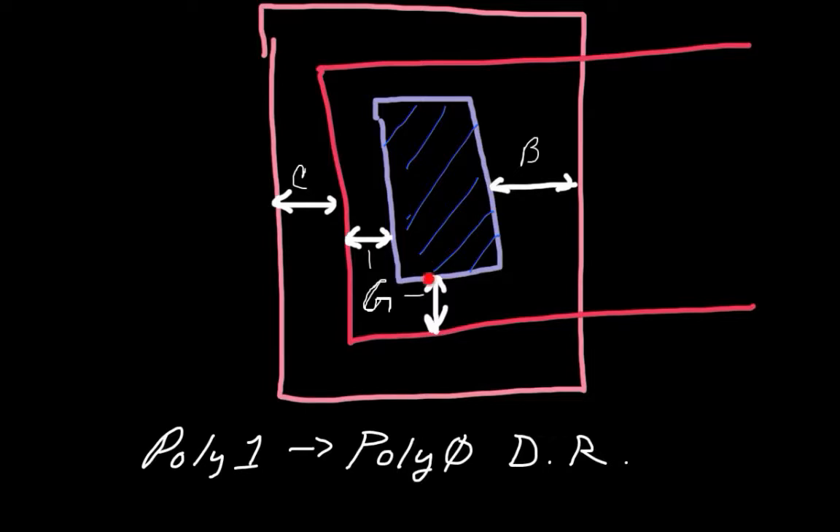And then you have an overlap criterion denoted with G here — that's rule G. You can look that up in the design rule manual. So you have to have a certain amount of overlap of the poly one to the anchor. Now if your poly one doesn't extend past the poly zero and ends inside the poly zero, then they want you to make sure you have at least this much distance. But here you see that it extends past it, so you're okay there. There's actually a rule that says it has to extend at least so much or more.